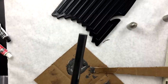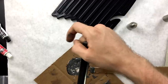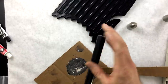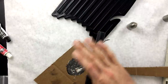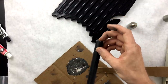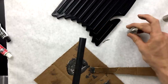When you go to sand, you're going to want to sand it outside on a windy day. You do not want to breathe in any of the inert dust that's going to be created from this. You just don't want to be breathing in any fiberglass resin or fiberglass fiber dust. It's totally inert once it's all set up and cured in this type of form, so just be careful like that. Do it outside on a windy day, make sure you wear a mask. You can also use a belt sander or any sanding drum to get those few thousandths off, probably about an inch or so down.